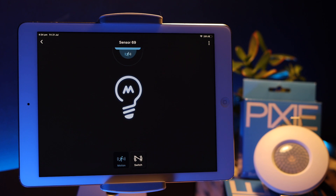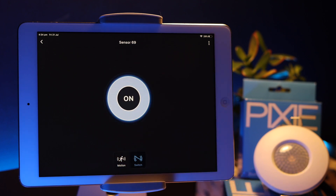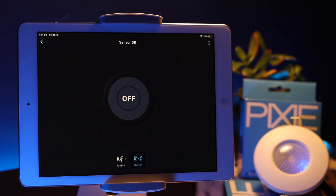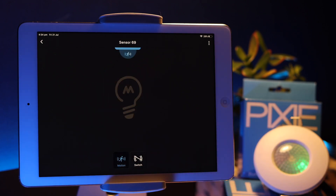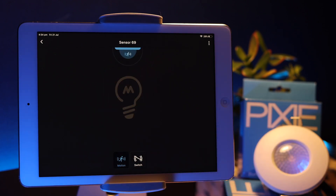Like the outdoor sensor, the indoor sensor has a number of operating modes, but just three instead of four. Auto mode: the sensor is operating as a sensor — if it sees motion, activate the load; after the timeout, deactivate the load. Override on: override the load on no matter what's happening with motion. Override off: disable the sensor and turn the light off. These modes can be scheduled or recorded as part of a scene, and you can change between them at any time.